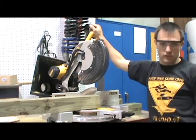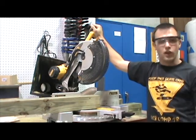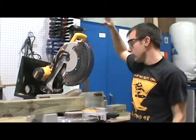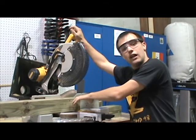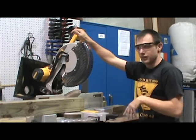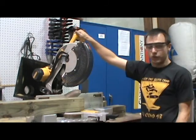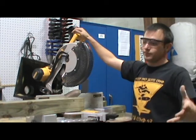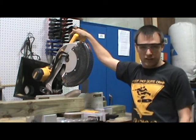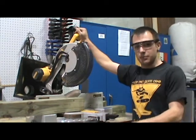We are just using a miter saw today — really just building our A-frames. Those are our focus right now: our two towers on the sides that will hoist our counterweight and firing arm in between. We've got all our angles calibrated to make sure they're flush when they connect with the base and the firing block. I've got the miter saw set to those angles, my lines marked on the 4x4, so I'm going to cut the component parts and then bolt together the final A-frame assembly and attach everything to the base.